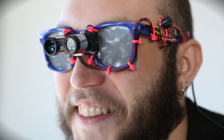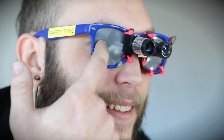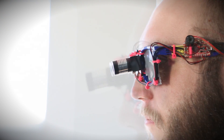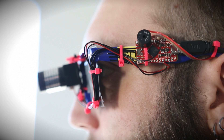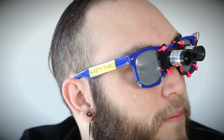I'm going to put this module through its paces today by trying to use it to navigate inside this room. I've built a pretty simple demo where I've taken the module and put it on the front of this pair of glasses, which I can't see through — I put electrical tape on the front. On the side I have a ProMicro which is taking readings from the module and relaying that information to me in the form of a tone. That tone gets higher pitched the closer an object is to the module. Also, if I get really close to an object, it'll alert me by vibrating using this LilyPad vibe motor taped to the back of the glasses.